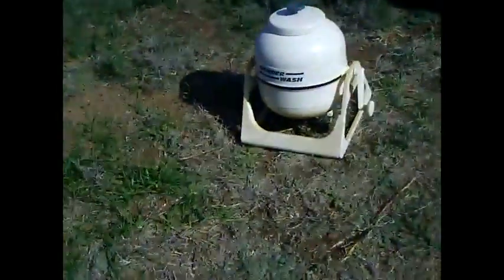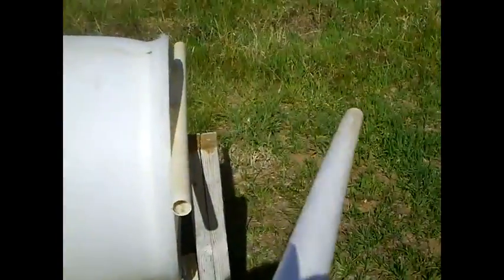After about 15 minutes, pull the plug off the bottom and drain the water. A better way is to put a bucket underneath and recycle that water by pouring it around your shrubs and trees — as long as you're using biodegradable soap, it won't hurt your plants. The washing machine only needs short pieces of PVC pipe added on the inside, about three feet long, fitting snugly. You screw from the outside of the barrel into the PVC so the screws don't stick out and rip up your clothes.